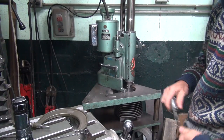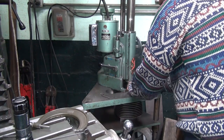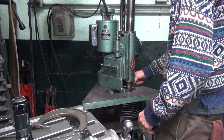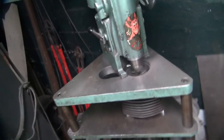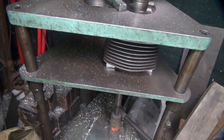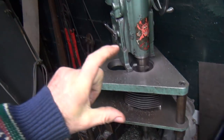Double check, and clean the tip off too. Lock it down. Make sure you don't hit nothing. Leave it in low gear this time - I'm taking a bigger cut. See the difference - there's a big chip flying out. It's got clutching on the table too. You fill a table up with chips in there - that's one bore job. When you're boring an 883 you'd stack chips just about this big.